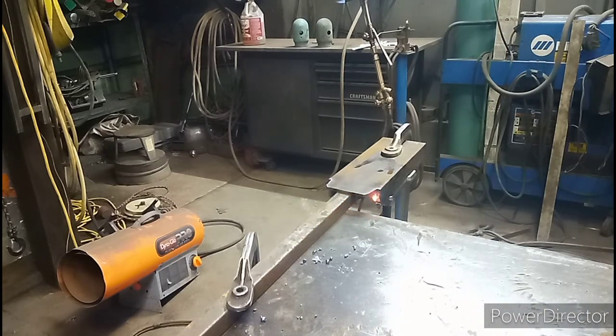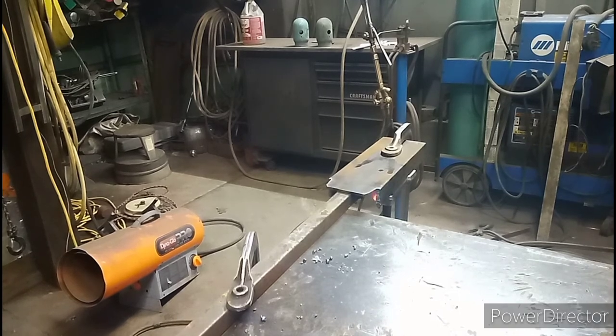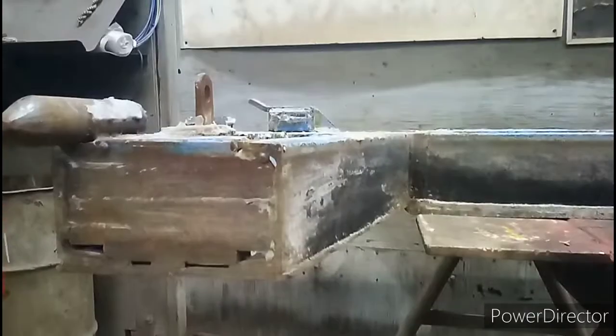Now I can move on to my next piece and keep going. The other side of that coin is you can use a grinder — they just come in from the side. It looks kind of ugly, and they didn't quite get the notch deep enough. But that's another way of doing it. At the price of cutting wheels and consumables right now, you just about kill yourself in overhead. Usually a torch is the cheapest way — you still got to touch it with a grinder, but not as heavy as if you're using your cutoff wheels and making that kind of a mess.